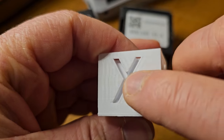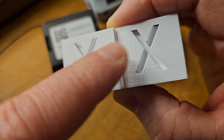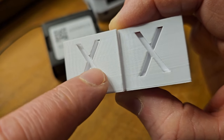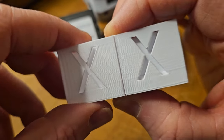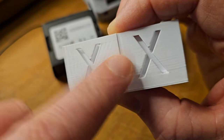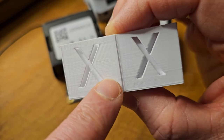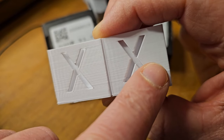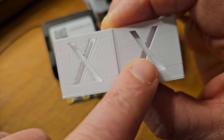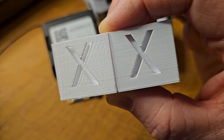As you can see, they're radiating out away from the X. Both of these are the exact same files printed at the exact same speeds — 100 millimeters per second on a bedslinger, which is a little bit more than I would actually run this machine. You have one with input shaping turned off and this is the one with it turned on. That's the only difference — I turned it off, printed, turned it back on, and printed again. The exact same file, same speeds, everything.